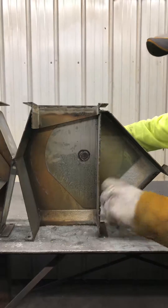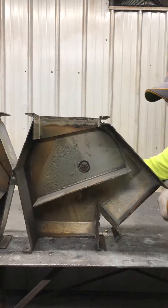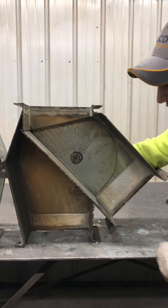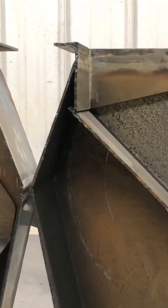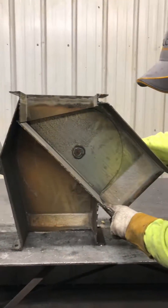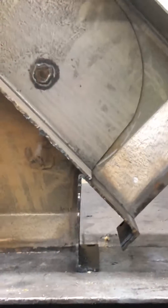We have a nice overlap between the crotch of our valve and our pan to make sure that we don't get spillage or leakage out around the pan. Then when we manually operate the lever and go to the offset position, as you can see up here in the corner, our pan actually kisses our inlet collar to create just a metal seal there to prevent spillage and leakage. We have a nice overlap at the bottom of the pan, which confirms our position nice and tight.